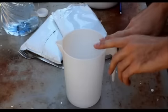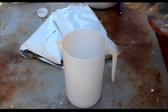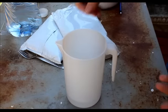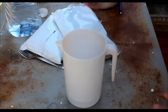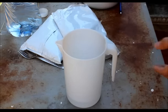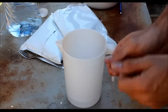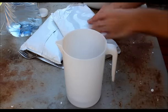So now I'm going to start by making the mould for your final cast. I'm going to start by adding a little bit of water into the container. The container should be the perfect size for your hand to fit in, so you can have your perfect pose and not waste too much alginate. I'm going to start by adding the alginate and then mixing it very thoroughly so you have a soft putty kind of feel for your final mould.